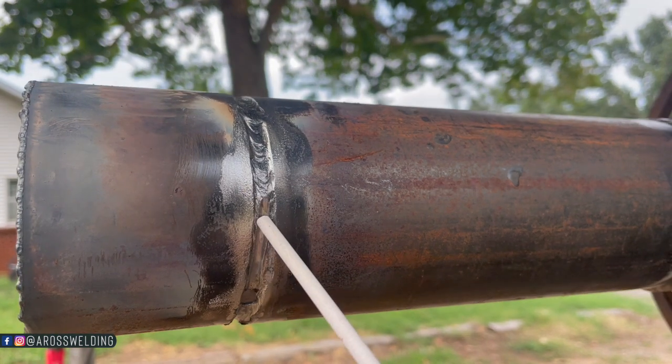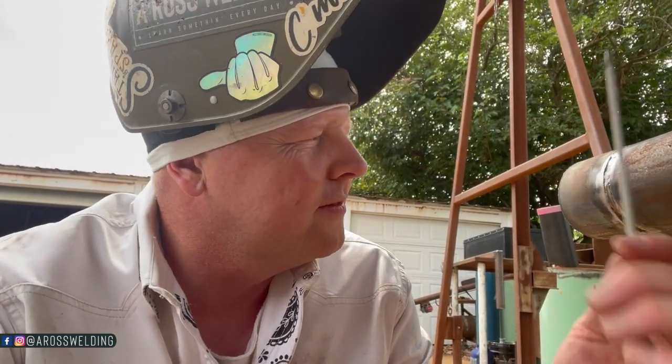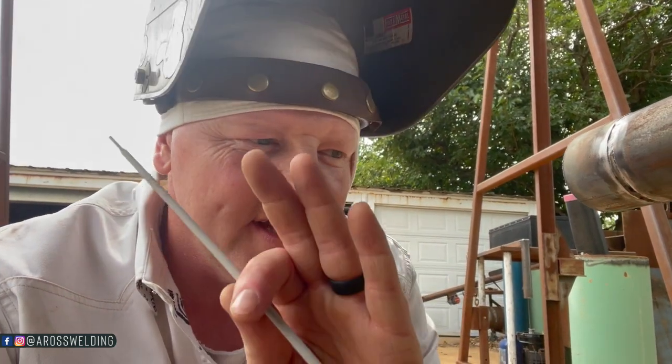That's tip number one — just stop welding once it happens, or keep your arc and jump up and keep going. Tip number two: stop and let it cool off. Go ahead and finish welding what you haven't welded yet and let that area cool off, then grind it. Letting it cool off is a key factor, because from my experience, if you try to fix it right away — depending on the size of pipe, especially on a small piece like two inch or three inch — the more you fool with it, the harder it is.